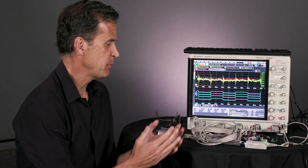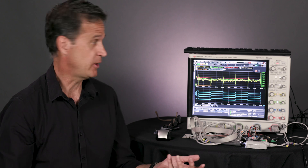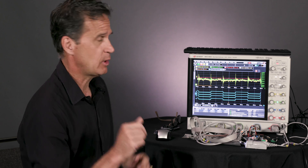Now I want to bring up this point about power integrity. This little board suffers from something that a lot of affordable electronics suffer from: they've got a form factor and price point that doesn't support quality power integrity. If you think about a server or the inside of an oscilloscope, we've got many power planes and ground planes to keep the power rock solid. With an IoT device, we've typically only got a couple of layers — so we don't have power and ground planes, we have power and ground traces. It's really hard for those things to have good power integrity, and if we yank the power around too much, we're going to start getting errors in the system. I'm going to demonstrate that right now.